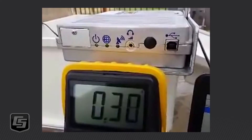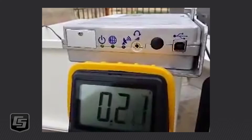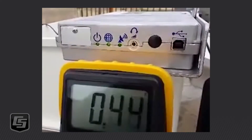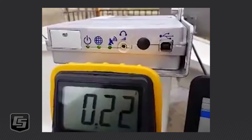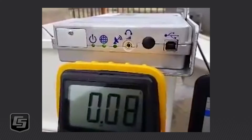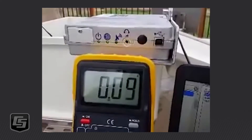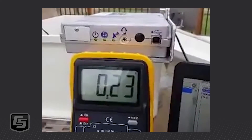So you wouldn't want to use this pin 9 deep sleep mode for a station that needs very responsive event reporting — like I've detected a flood event and I need to turn it on and tell somebody right away. It's going to take a few minutes, probably about two minutes, to come up. We're still not on yet, but it's great for environmental monitoring. You know, you turn it on and report your data once an hour, something like that. Or this is a backup for an event reporting network — you keep it in the deep sleep until you need it, then you turn it on and leave it on and keep it on the network. So it's on the network now.